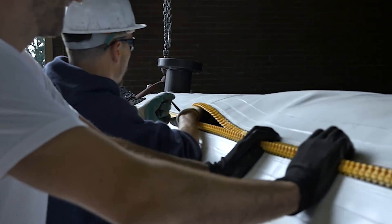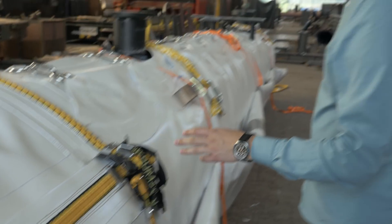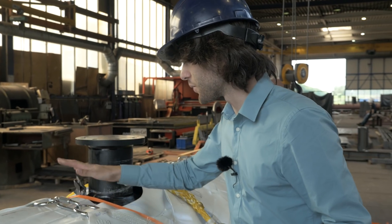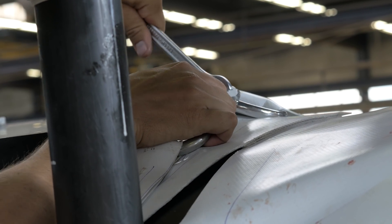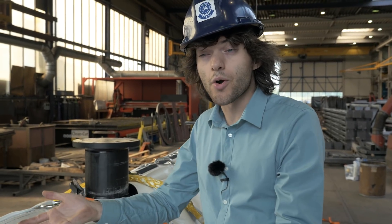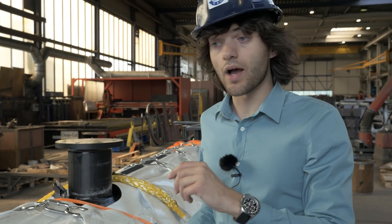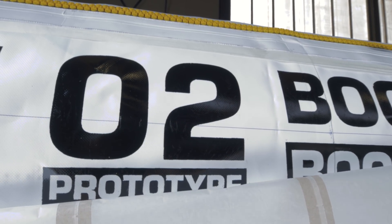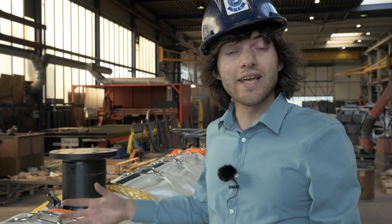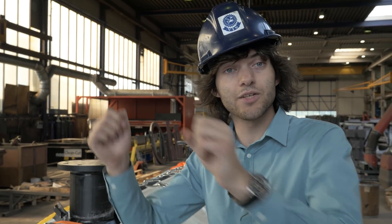There are really three ways in which we can connect those two parts. The first way is with a massive zipper, which is what we're seeing here. The second way is with a shackle, also known as a quick link. Both of these methods require the screen to go all the way around the pipe. There's a third way that we're going to test on the second test section, which will be deployed later — that one isn't going around the pipe but is suspended at the bottom of the pipe connected with a rail. These are the three connection options we're considering during the North Sea prototype.